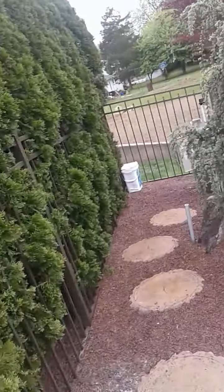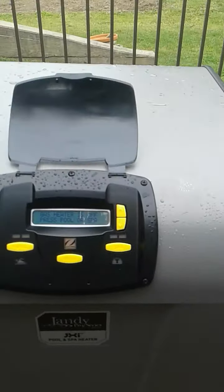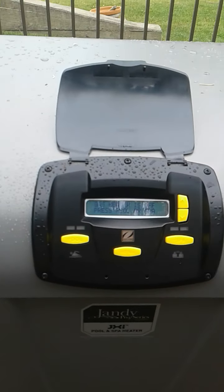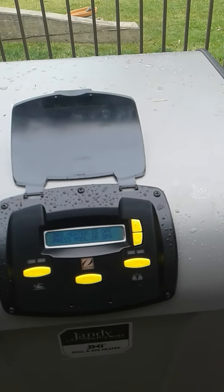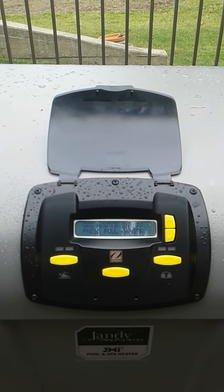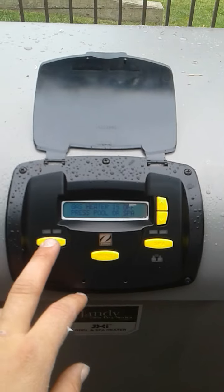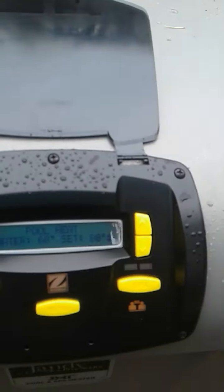Using your Jandy heater, take a walk off the equipment, make sure your filter pump timer is on. Here's a nice new Jandy heater. When you get to this setting, you have pool and spa — that just means it allows you to have two different temperatures set. This won't change the valves for you; you still have to do your normal valve change if you want to use the hot tub or be in pool mode. We're going to pool heat — you can see it's set at 80 degrees.